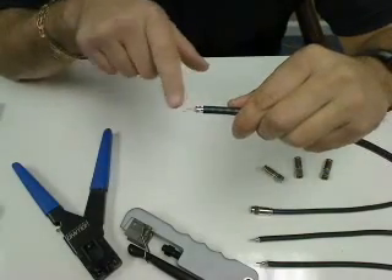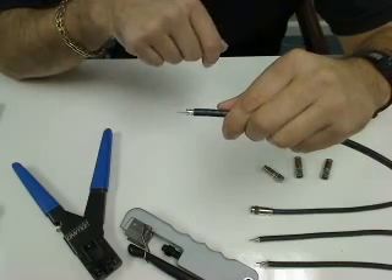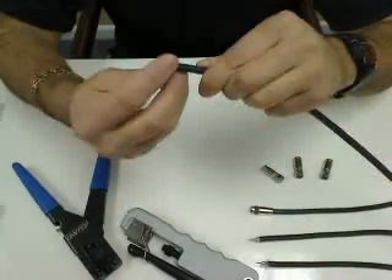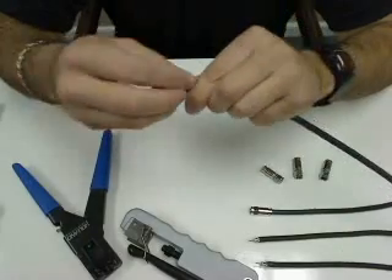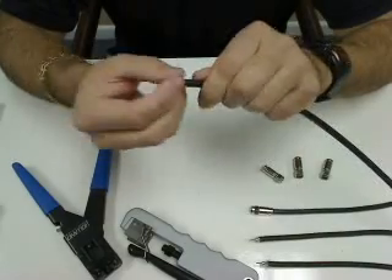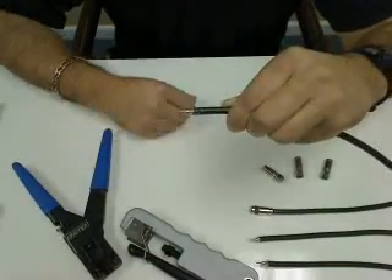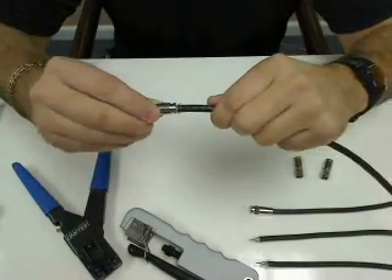Now what we have is an industry standard which is a quarter-quarter: a quarter inch of exposed center conductor, quarter inch of braid shielding and foam dielectric. What we do next is we pull back the braid over your PVC jacket. You want to make sure that your center conductor is also clean and free of any other braid, so I'd like to just make sure by rubbing my nails across the top there. And our final step is actually going to be to insert a compression connector over the coax cable.